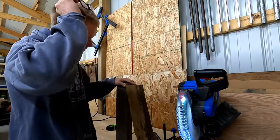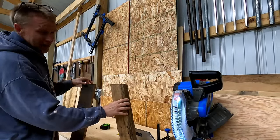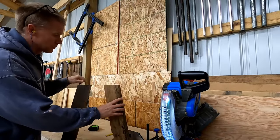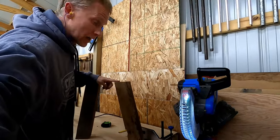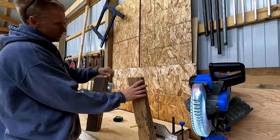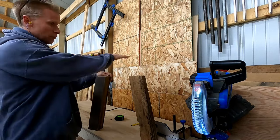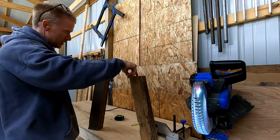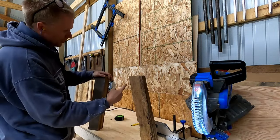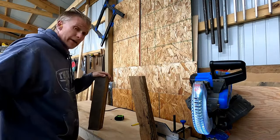Starting to put together my legs. I can't really envision it right now, is what I'm pointing out here, but these are my two legs. I cut these at 10 degree angles. And so the table is gonna go this direction, 4 foot this direction. There's two legs here, there's gonna be two legs down there. We're gonna attach another board here, here, and then one straight across there.